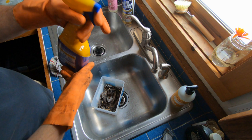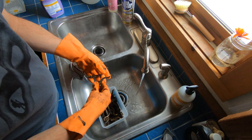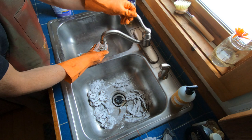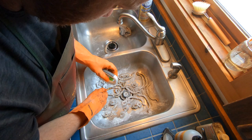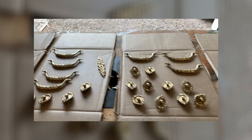I had a couple of hours before I could put the second coat of paint on, so I changed my focus to the hardware. I used the ZEP degreaser and rubbed each piece down and that really did a great job at taking that oiled finish off. Then I grabbed my Bar Keepers Friend and began to polish them. There was a lot of hardware and I think I stood at this sink for a couple of hours polishing these pieces. Unfortunately in the end they did polish up nice but they polished to a bronze look — maybe a brass — and I was looking more for gold. So after a couple of hours I did give in and hit these guys with a light coat of metallic gold spray paint, and that really updated the pieces and gave me the look I was shooting for.